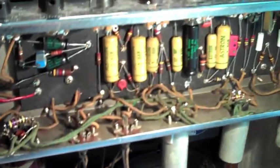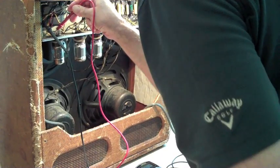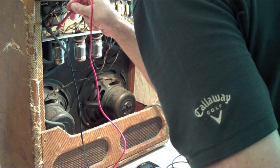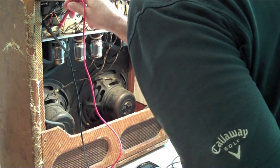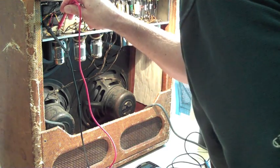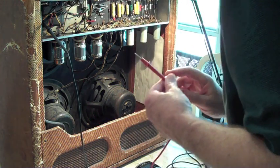I'm just seeing if the amp is running correctly. You guys know it sounds great — I'm not gonna mess with it, I'm just curious. I want to learn more about these things. And if I do die, please tell my wife to post it on YouTube so everybody can see what not to do. Voltages are going to be the same — maybe not. Let's see. 353. A little bit lower. 353 is supposed to be 325, so 25 volts off.